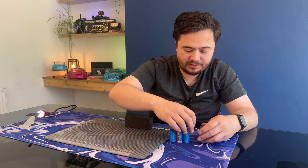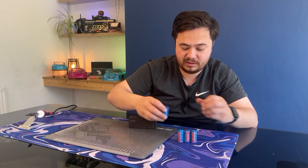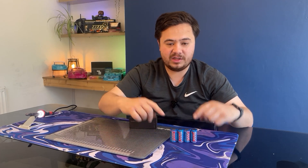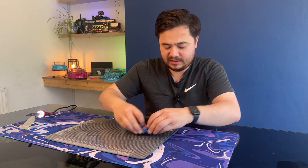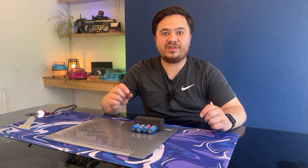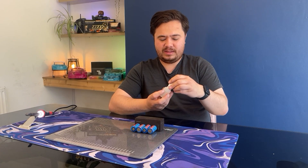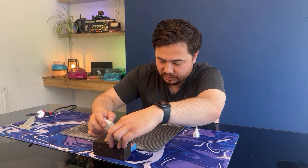I've got my batteries alternating: positive, negative, positive, negative. Our bars will sit on top for when I glue them together. I'm going to lay them on the side, push them up against a flat surface, and put just a little bit of super glue to keep the battery pack together. Later on we'll go over it and reinforce it with a bit of silicone. Just pop the cells together like that and wait for the glue to dry.